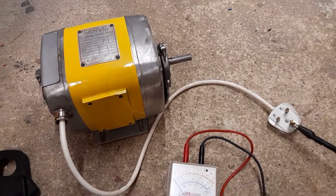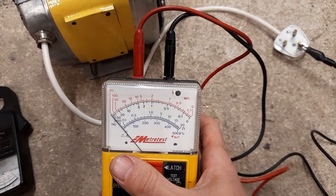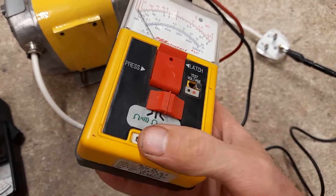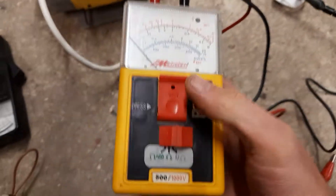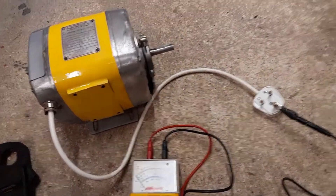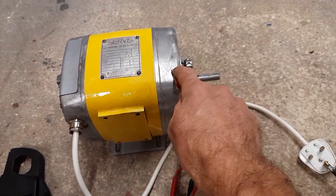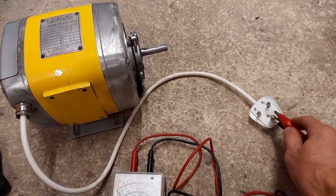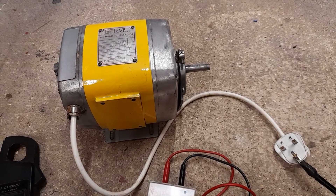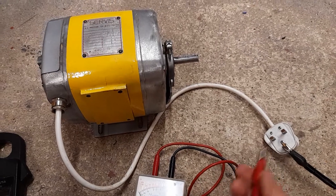The first thing we're going to do is use this meter to check insulation resistance. There are a couple of settings — I can check at 500 volts or 1000 volts, so we're on the 1000 volt setting. We need to check that the insulation is good between the grounded parts of the motor, like the case, which I can get to via the earth pin on the plug, and the windings. To get to the windings I'm going to clip the other probe onto the live and neutral.